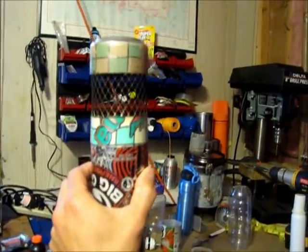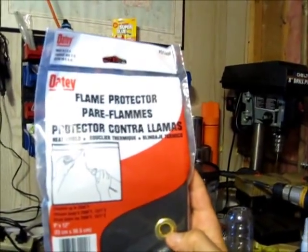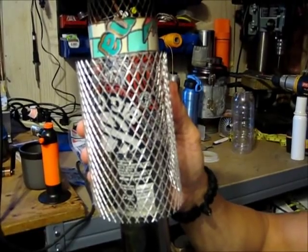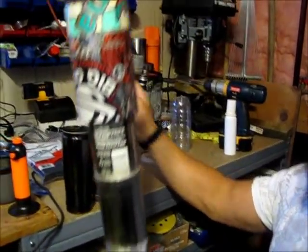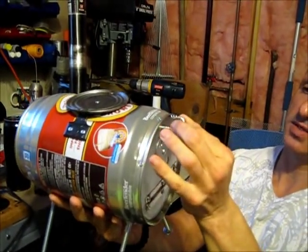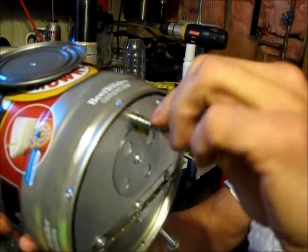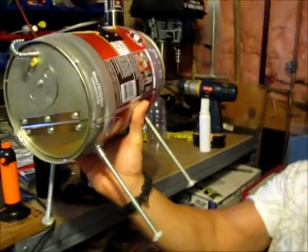There's a spacer made from the wicking material from a wood stove. This will be the area where there's a bypass — most likely the vestibule is where I'm going to be venting this from. This area passes through the tent material on the vestibule with some aluminum screening around it. I haven't fine-tuned this yet, but I'll use some carbon felt around it just to make sure there's not too much heat in contact with the tent fabric.